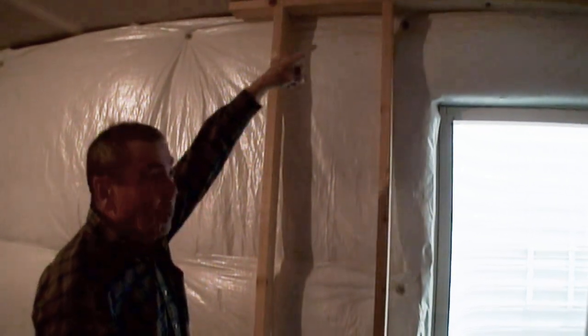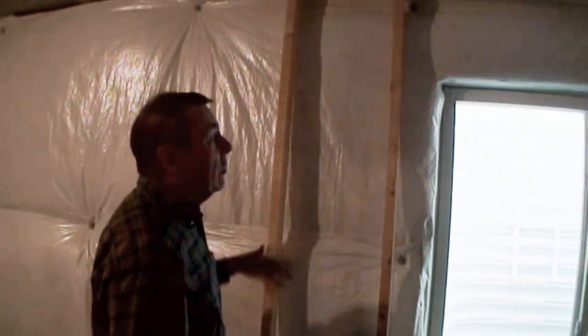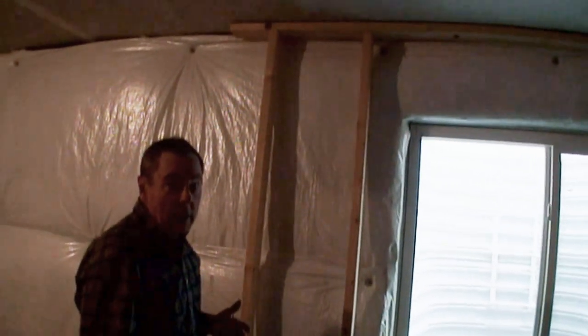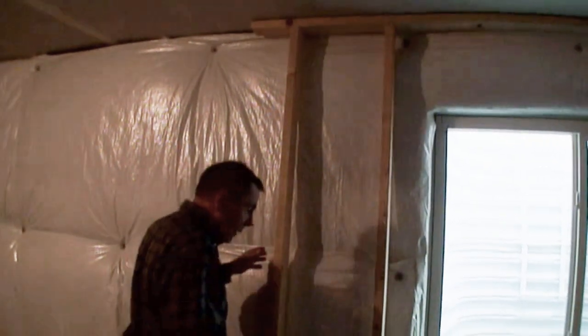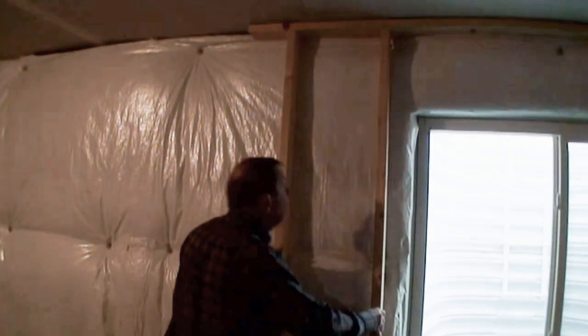Okay, because if they are, then that stud somewhere will end up right under that floor joist. They're 24, this is 16. So what I did was I started, this one should be 6 inches over from the floor joist. That means there are no multiples where they'll be the same. Gotcha. So many things to consider.